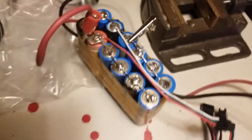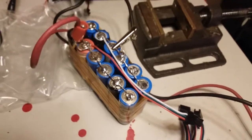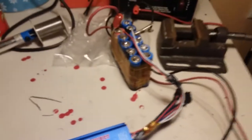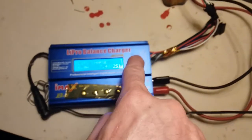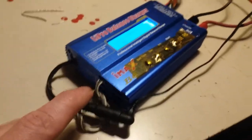Any good flux will work — you just get the solder hot enough and it works pretty well. That's the best method I've found for connecting these cells together. They're 18650s from laptop batteries, and soldering them together seems to be the best way I've found to connect them.